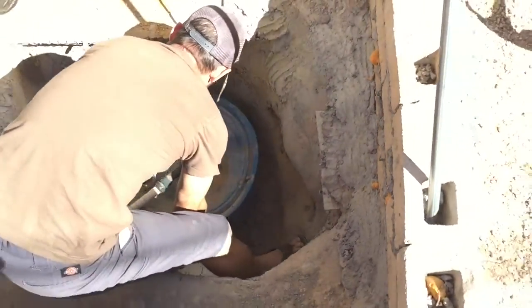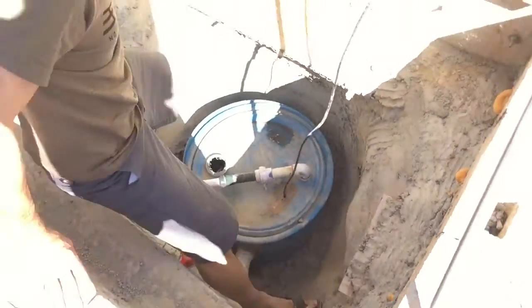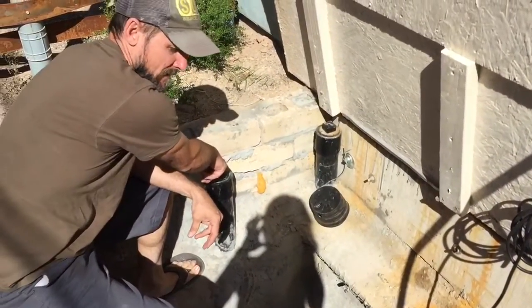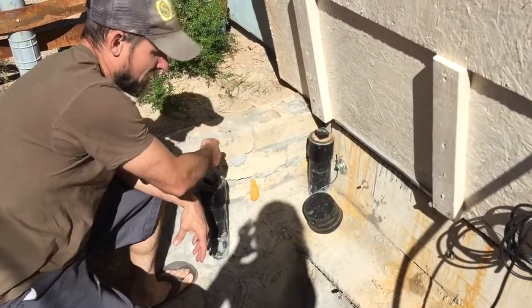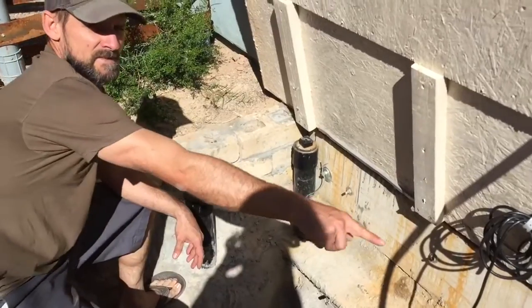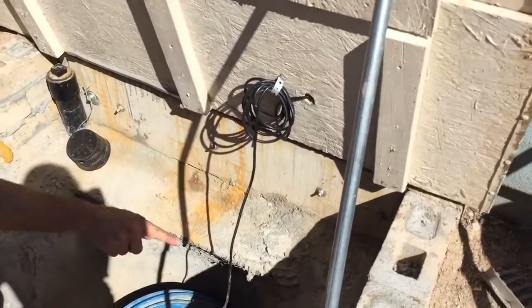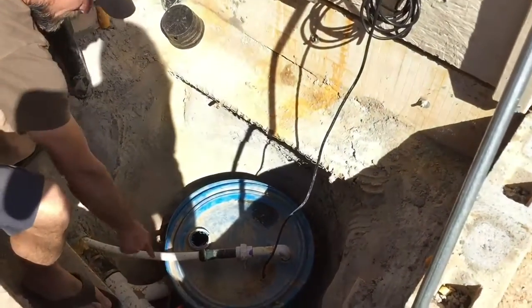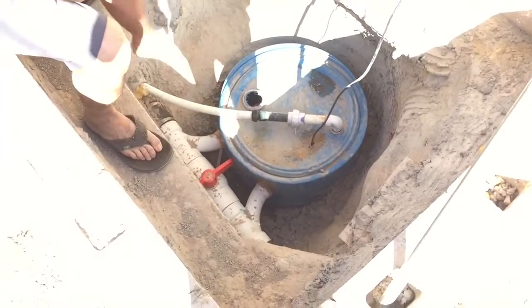Before I move the lid aside, I want to show you a couple of valves. We've got two valves set up here with the gray water coming out of the house — these are the gray water pipes. It's plumbed separately from the toilet and the kitchen sink. The toilet and kitchen sink clean-outs are over here, and the gray water actually joins up with the sewer.